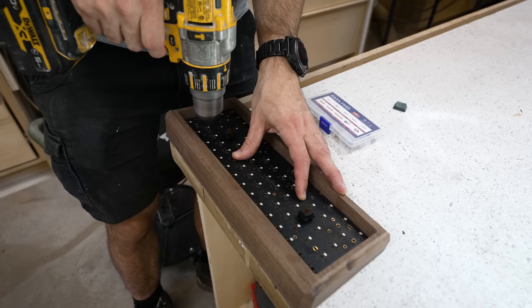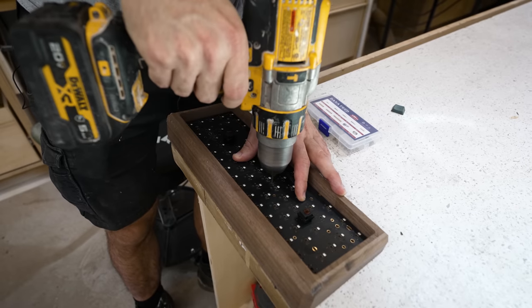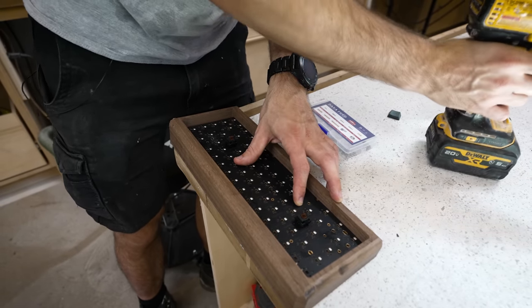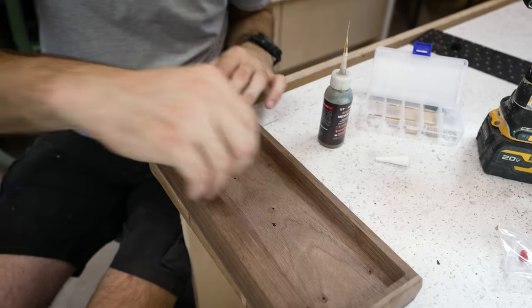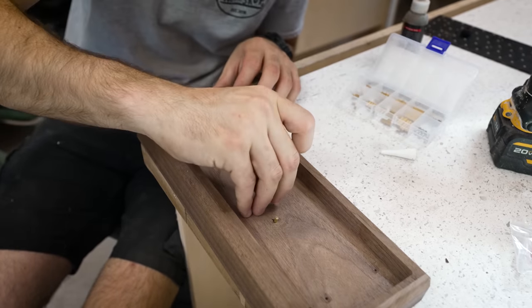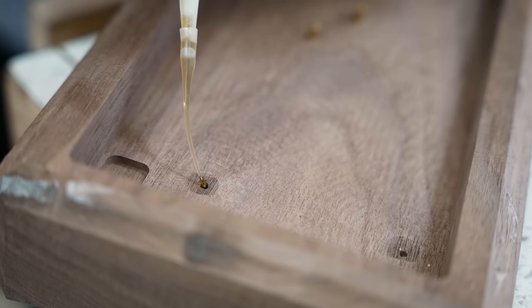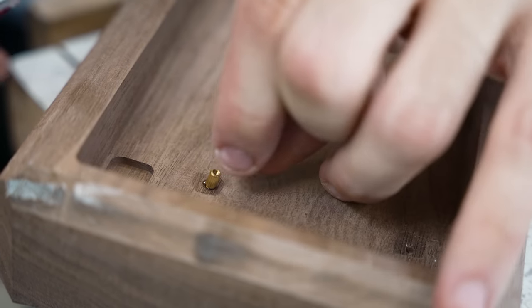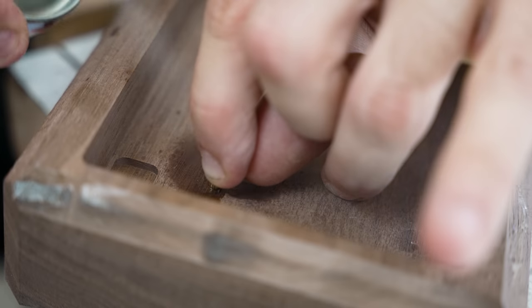If you're new to my channel, you might not know that one of my favorite things to do is to use PCBs as templates for drilling holes. It works great, and for some reason, it really seems to rile up a certain type of commenter. I used each of these holes as a location to mount a brass standoff that elevated the PCB a few millimeters off the bottom of the case. And just to be safe, a little drop of CA glue in each hole really helped to fill out the threads and provide a more secure connection.